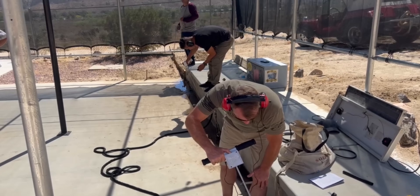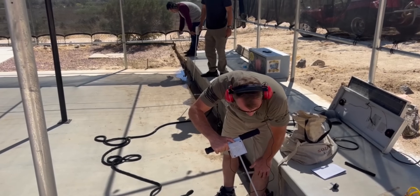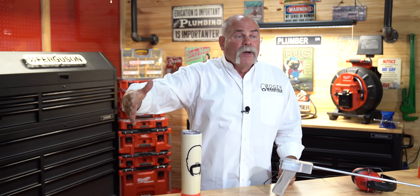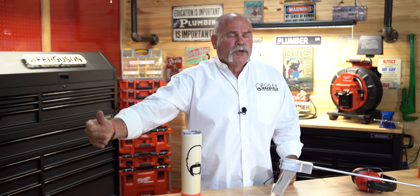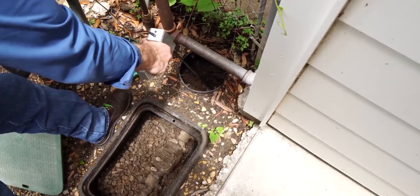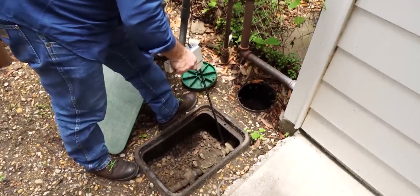Go back and listen to those angle stops again to double check yourself. Once you figure things like this out, you can tell the homeowner where they have a leak. A lot of homeowners will ask why their meter is spinning — it's spinning because they have a leak, and you can come show them that. I like to turn off a valve at the water heater or at the yard box to make the meter stop spinning. If that's what they've told me — that their meter is spinning — I can take them out and show them: when I shut this valve, the meter stops spinning. Now they see it and it's very clear in their head.